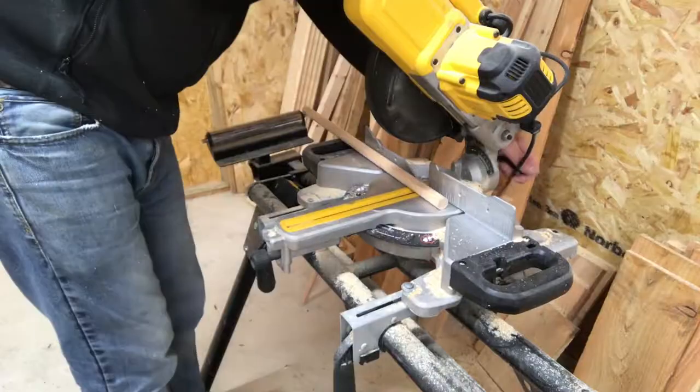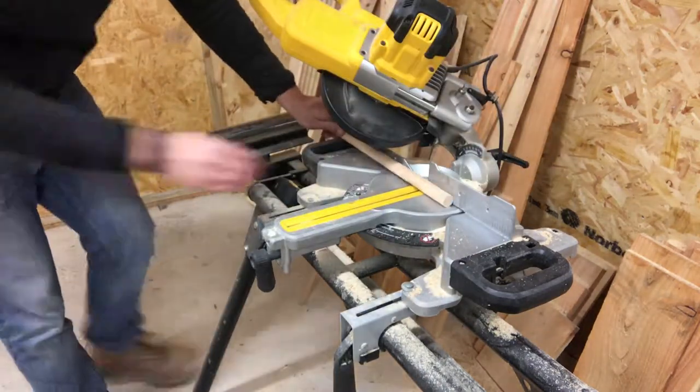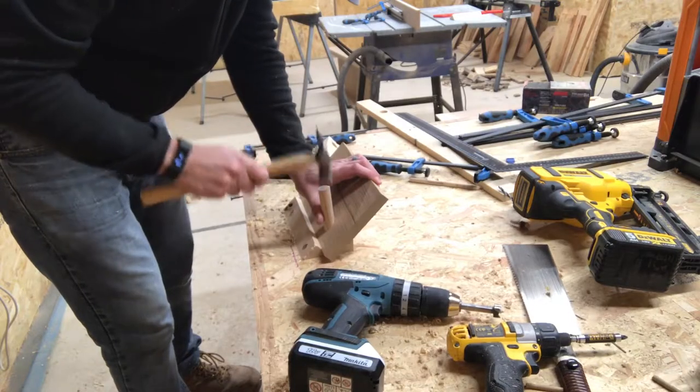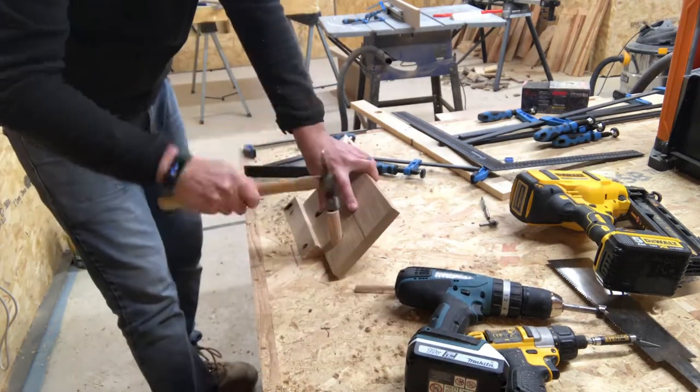A clean 45 degree 3/4 inch hole in the oak board. To insert the oak dowel you need to cut it also at a 45 degree angle, so I did that on the mitre saw. I then placed the piece back on the jig and using a tap hammer drove in the oak dowel until it came out the back of the oak board.